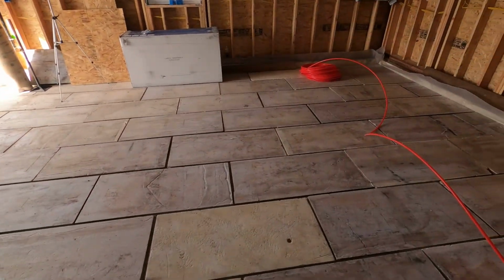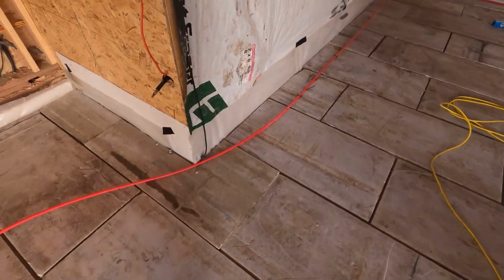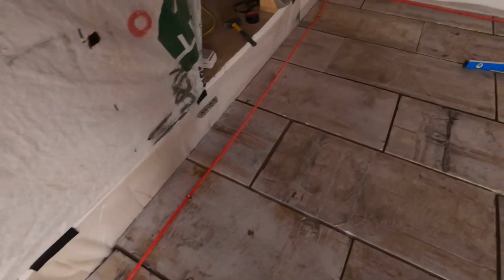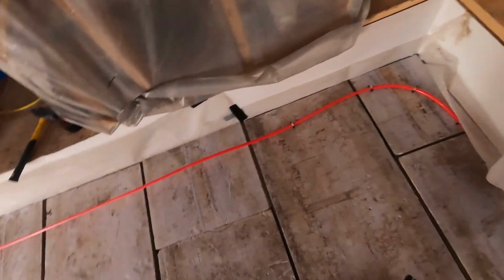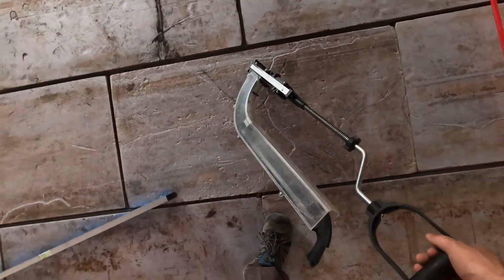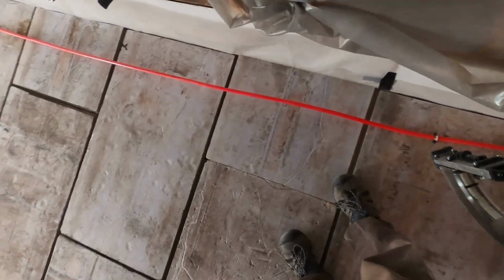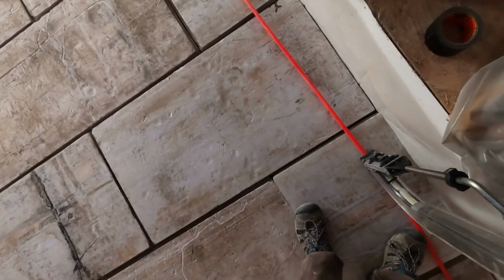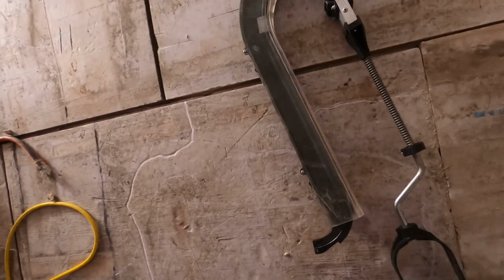So it looks like all of our foam is in, and as you may remember from the basement pour, this was all recycled from the lecture hall from the university here. Instead of zip tying the radiant down like I did last time, one of the plumbing wholesalers here rents these out, or lets you use them if you buy the staples from them. So basically, you want about every 3 feet. You walk up and just boom, it's in place, secured. There it goes, and it's pretty neat how it works.